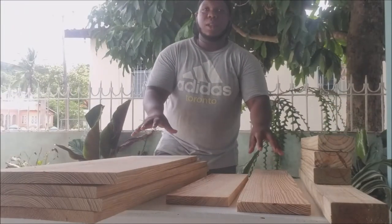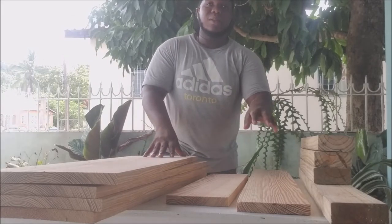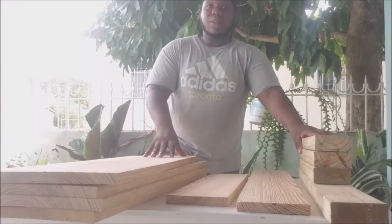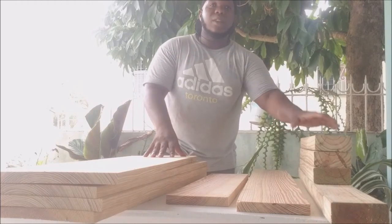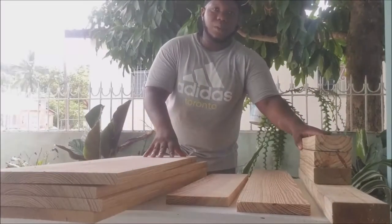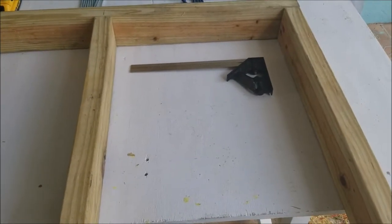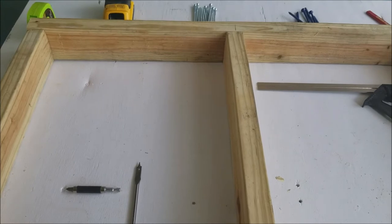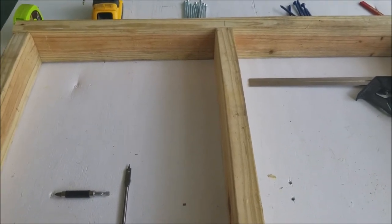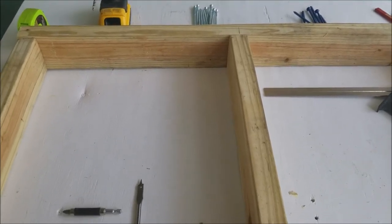Alright guys, these are all my cut materials: top and bottom panels, side panel, front panel, and the rack. These four pieces of 2x4 are going to form the rack that'll be the support for the desk. Let's put together the rack and get it installed. This is what the rack is going to look like — I've just pre-put them together, haven't screwed or drilled anything yet. The dimensions are going to be two by two feet by three feet, as noted in the description below along with the list of materials.